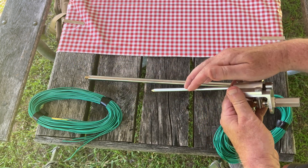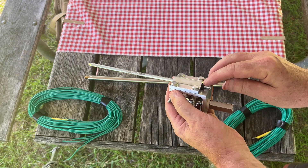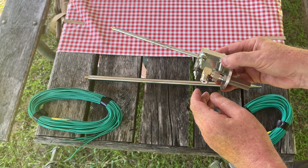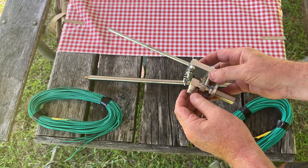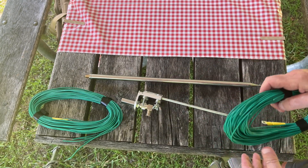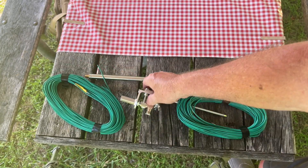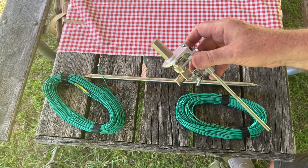Here's the base with a nice spike in it. When you get it, you have to loosen these and move the spike down — there are a couple of rubber grommets in here, and you just snug it back down after you do that. These wing nuts will be for the counterpoises that come with it. It comes with a 90-degree right-angle adapter to connect your coax, and of course where your telescopic whip screws in. It also has two sets of radials, counterpoises. My guess is you want to deploy them all, mounted between the washers, and then put the antenna up.